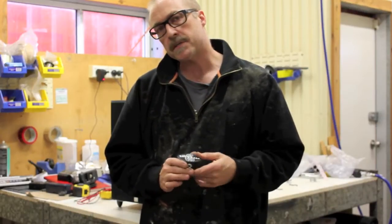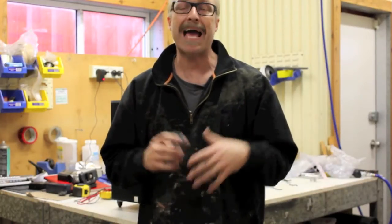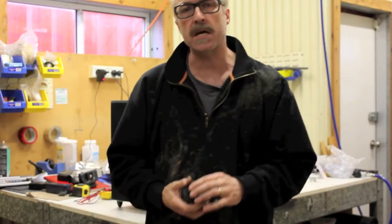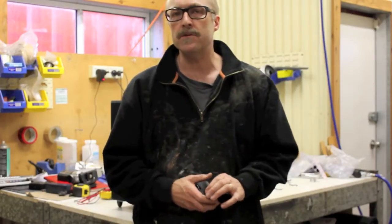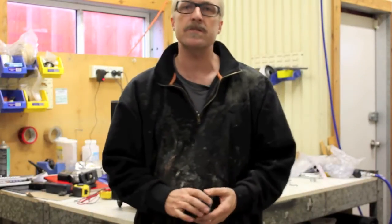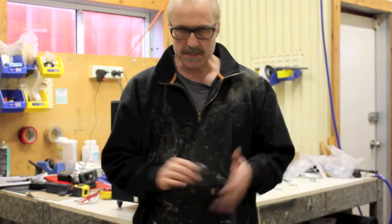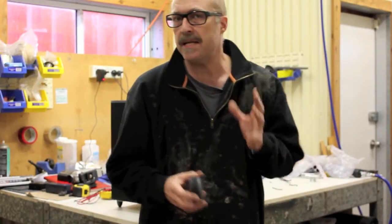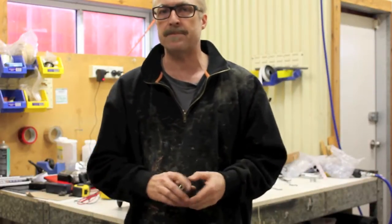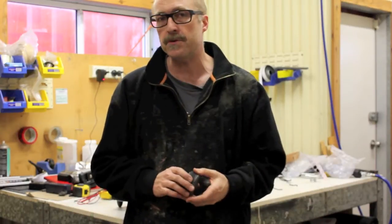And one question that keeps coming up all the time when I'm manufacturing these stomp boxes and pickups is, what kind of amp do you use to get the maximum sound out of your acoustic guitar and also out of your stomp box? Now, this is not as easy as it sounds, because if you don't have a huge PA with big 18-inch woofers and stuff like that, you're not going to get a really satisfactory sound. If you're just running around with a little acoustic guitar amp or an electric guitar amp or something like that, there really isn't any bass in them, because they're open-back amps and they're not designed to reproduce the kind of bass that a good stomp box will produce.